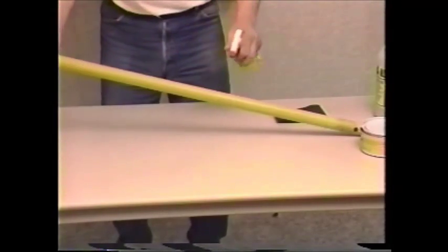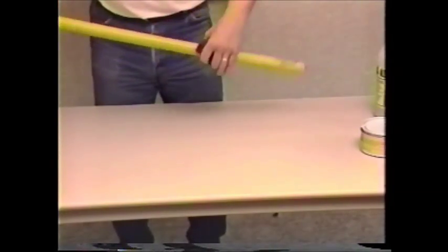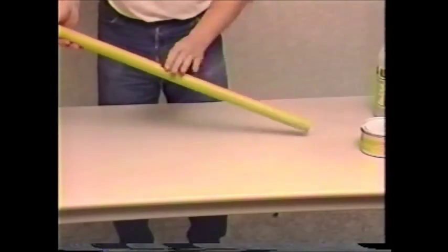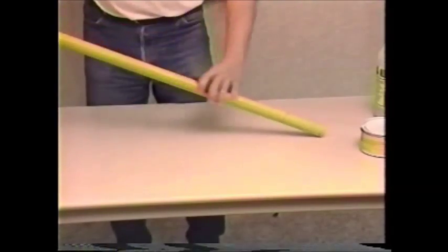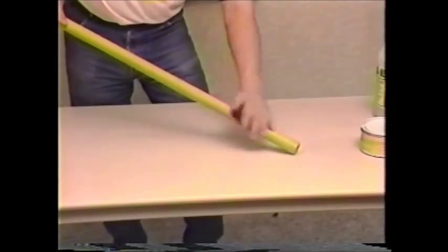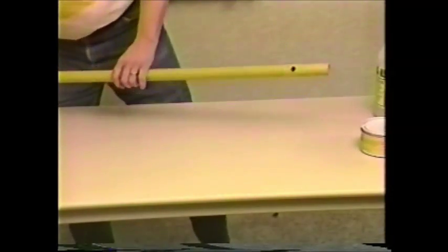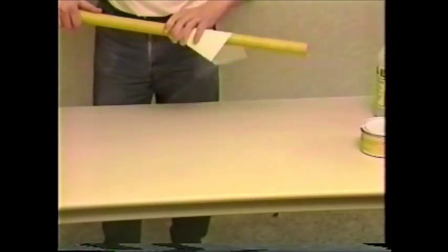For cleaning this fiberglass tube, we are using Hastings Fiber Glass Products all-purpose cleaner, which is recommended for all fiberglass surfaces. It leaves no residue and is completely safe for use. Ultrafine cleaning pads are extremely helpful in cleaning areas that have dirt and contamination deeply embedded in the surface. After cleaning the surface of the fiberglass stick to be retested, you must ensure the fiberglass is completely dry.